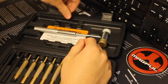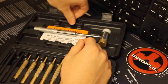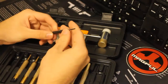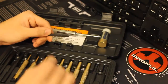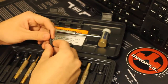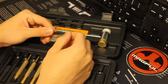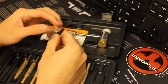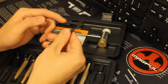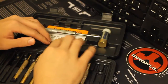It's a very nice small punch for small pins and things like that. Then you have a 1/16 punch, same configuration — steel, very small. One thing I found out with this particular kit is that these are going to bend fairly easy. No biggie — just take your vise and tap that lightly with a ball peen or small hammer and get that back to formation so it's straight. You kind of want that to be straight because you don't want it to slip off. You want high quality work and high quality tools.